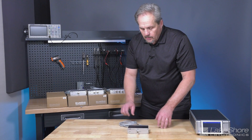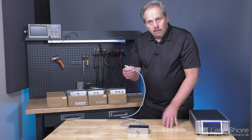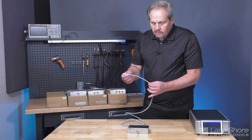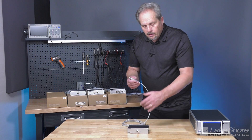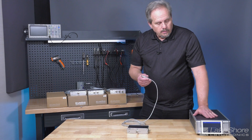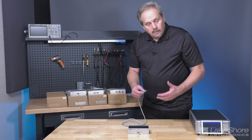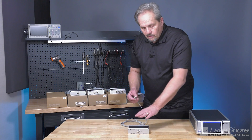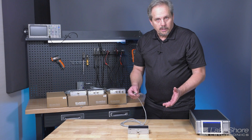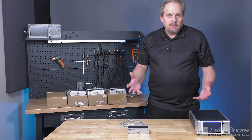More modules are in development. One thing common to all modules is the inclusion of a standard 2-meter-long cable that connects each module to the instrument. This cable provides a noise-immune signal path and allows up to a total of 6 meters between any amplifier module and the instrument mainframe. We sell an optional 4-meter extender. Some large installations benefit from having modules very close to the sample, minimizing noise pickup — making the M81 a modular and physically distributed system.